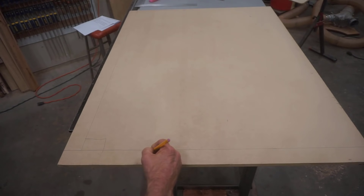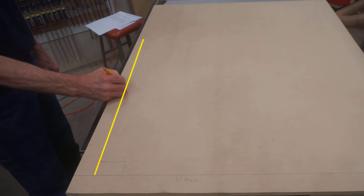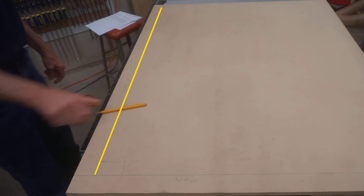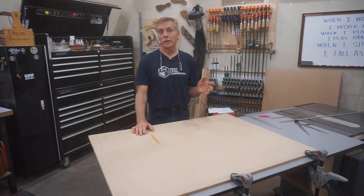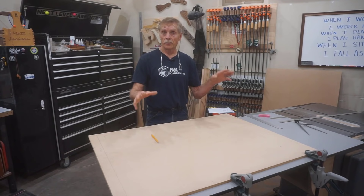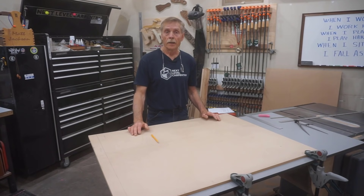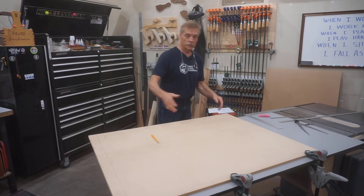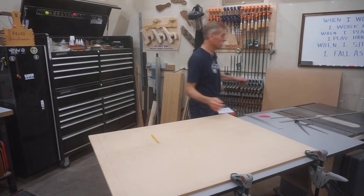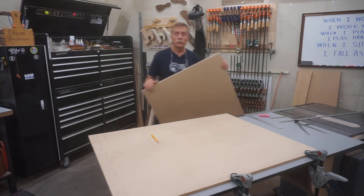This is the bottom back corner of the stairs — the side of the sheet represents the wall and the bottom represents the floor. I didn't draw the floor line sloped like actual garage conditions, but I'll account for that reality later. I draw the plan on this sheet, do all the figuring, make any adjustments, then transfer all the measurements to the actual material — three-quarter inch HDF — that I'll use to build the box for these steps.